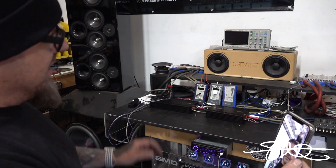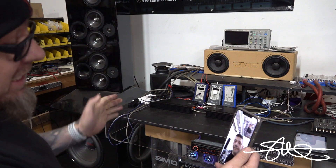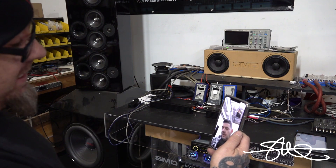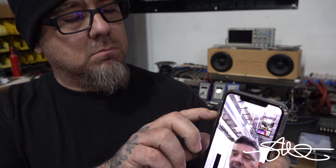E750.1, E350 — these are Class D amps, right? I know you're all about Class A and Class AB, but Clean D. Can you please explain why this is cleaner than regular Class D? The process is pretty much the same as any other Class D, but what makes it clean is the kind of filters that we use in it. We saw a problem with all the Class D's that we had tested — when they clip, they get really ugly, and at high frequencies there's a lot of garbage that still comes out, and it had to do with the output filter. So we use really good output filters, and also we have EMI filtering on the B+, which was the other part of the Clean D.